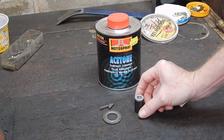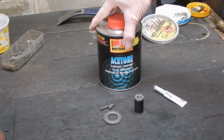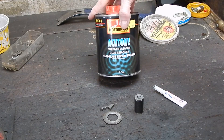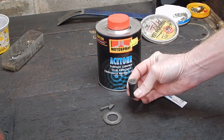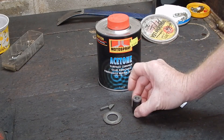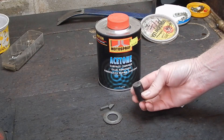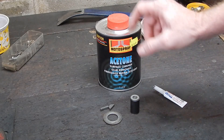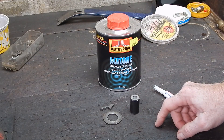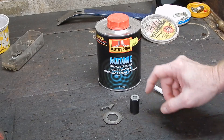Right, well here we are. We've glued the washer onto the round stock with the super glue. As you can see I've got some acetone here — you need that to clean up the washer after you release it. It's also handy to make sure you don't glue yourself to your job. It's embarrassing sitting in the doctor's queue with a piece of metal stuck to your finger. To get the washer off you're just going to heat up the round stock afterwards with a blow torch or put it over the gas stove and it will just drop off. Then use the acetone just to finish it off and you're good to go. So I'll put this in the lathe chuck and we'll face it back.